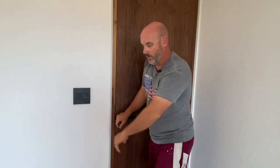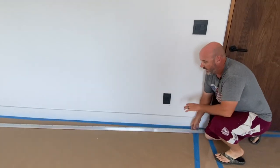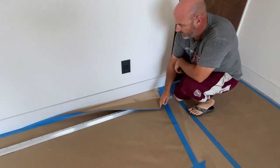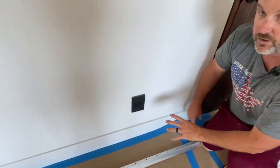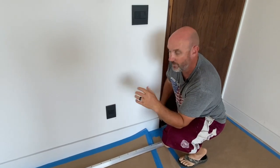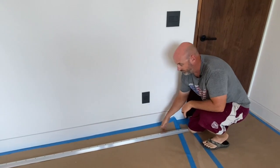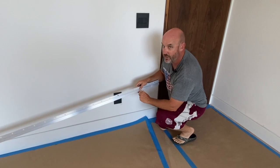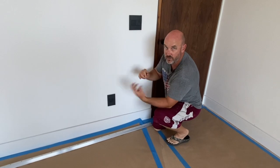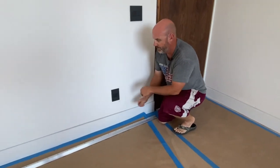As far as on the floor goes, this went just like this on the wall. So what happens is you have to know your floor covering. In this case, we've got a beautiful hickory engineered wood. You've got to know what you're going to use for thickness before you get to sheetrock, so you kind of have to have your cart before the horse. You make blocking that's going to allow for the floor and then the trim to come up just where you want it on the riglet. Then the drywall hangers hang the sheetrock with these blocks under it instead of hanging it to the floor.